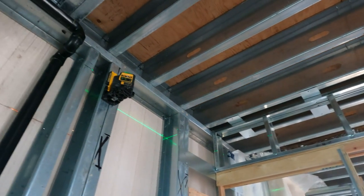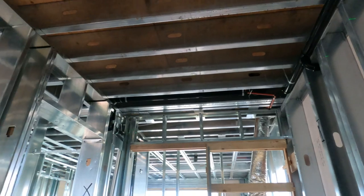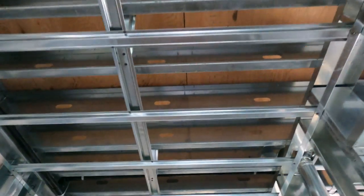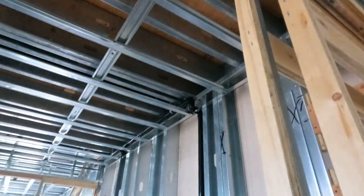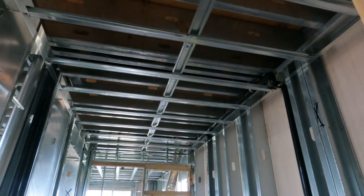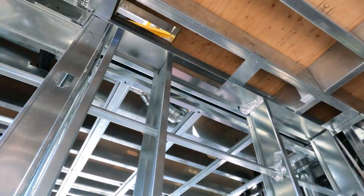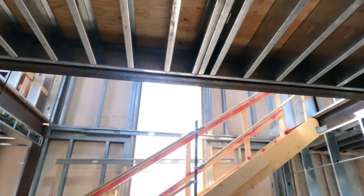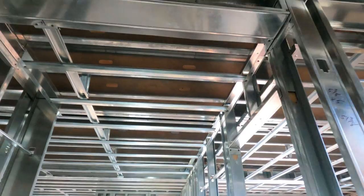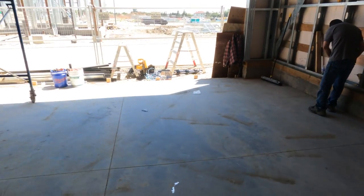This is my way of doing it without hanger wire or anything like that. This is a bathroom ceiling — a quick one. I've done the bulkheads already: one side's a shower and the other is the toilet area. I've got one bracing run right down the middle and kickers every four feet — it's beautiful, it's so strong. That bathroom is five feet wide so I've got a nice brace down the middle. And that's just on the outside where there's an open area — there's going to be an elevator and the stairwell right in the front — so I put a bulkhead and tied it right into that lower floor joist.